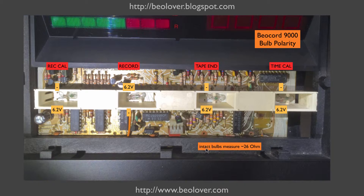It's interesting to note that an intact light bulb — I measured that on these two — is about 26 ohms. That can help to identify if a light bulb already has a problem or not. But this light bulb here, because of the thinning filament, had a larger resistance.